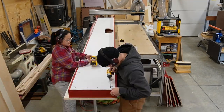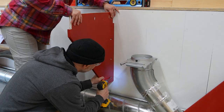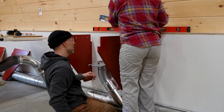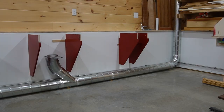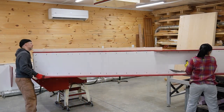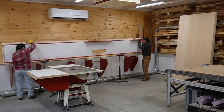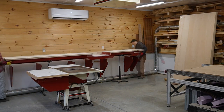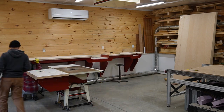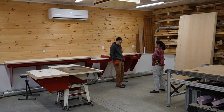With the box complete we started mounting the legs to the knee wall. I used a level to mark plumb lines at the right locations and screwed in the first leg. Shimming where necessary, we leveled each leg relative to the last and proceeded down the line. Note that the knee wall is three-quarter inch plywood so I can attach anywhere, but if you have a stud wall make sure you're screwing into solid material. At fourteen and a half feet long you'd think this would be heavy and awkward, but it was remarkably easy — we stood it up on its back, slid it onto roller stands, then pivoted it into place and lowered it onto the legs.